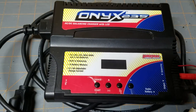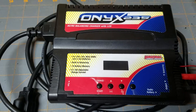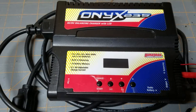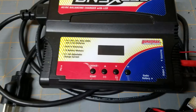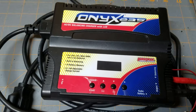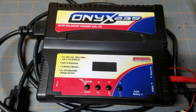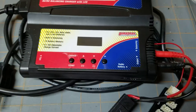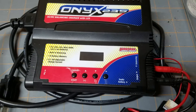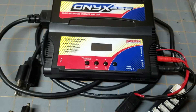This is what I'm going to recommend for your average weekend RC guy. This thing will charge anything you want — it will only charge LiPo up to 4S, but it's programmable and will charge about any kind of battery. This is going to do the job for most people. It will charge up to 8 amps, so it will get your battery charged in a pretty good amount of time. It has a lot of features, you can change out your plugs to charge several different types. It actually even has a 5-volt port where you can plug your cell phone in and charge it. That's going to get it done for most people.